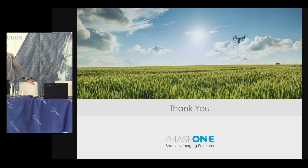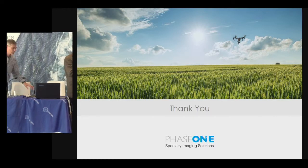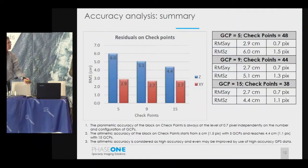One more question? When you make aerial triangulation with this camera, what is the expected accuracy of the triangulation in terms of pixel size? Actually, it was presented in this. It's about 1 pixel, less than 1 pixel in position and about one pixel at height. But you actually have two parameters.